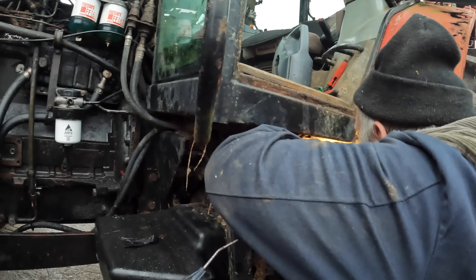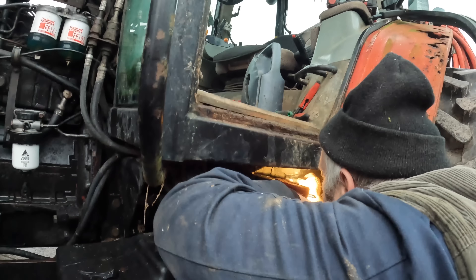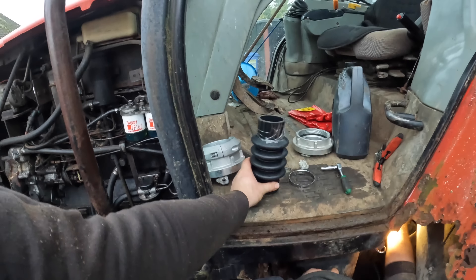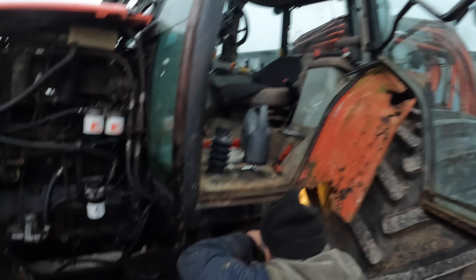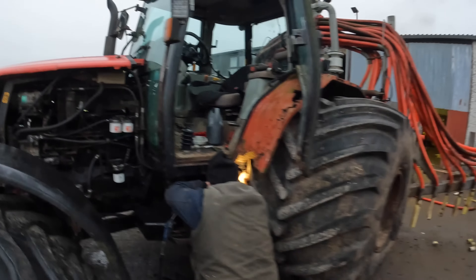Father Phil is just working on the diesel tank. You can just see the rubber boot in there between the bottom tank and the top tank — it's perished and starting to leak, and the fuller the tank the more it leaks. He reckons it was only changed once before on the machine. Getting that replaced now.